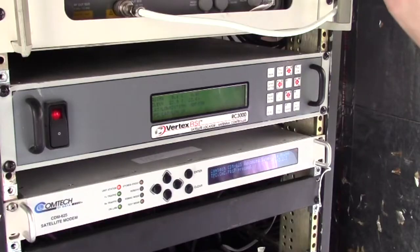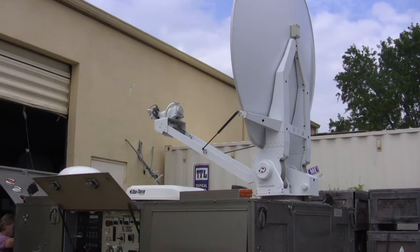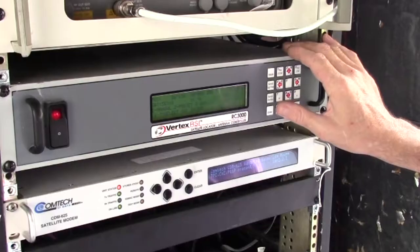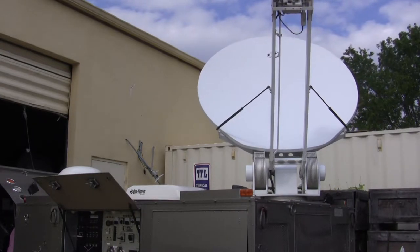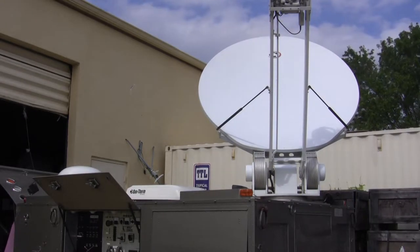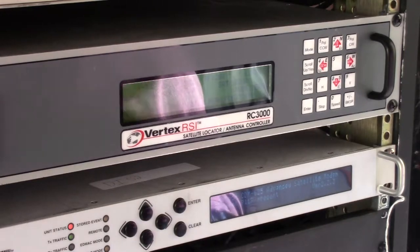The antenna is now standing up — it knows its longitude and latitude, and it's setting the heading from the compass. I've stored a few satellites; I think it holds up to 20 different satellites. So now we'll locate. This takes a while. What has occurred is it's actually scanned through the satellite — you haven't seen that because the camera isn't pointing at the spectrum analyzer — but it scanned through, found a peak, went further to make sure there's no stronger peak, and then came back to the actual peak signal.